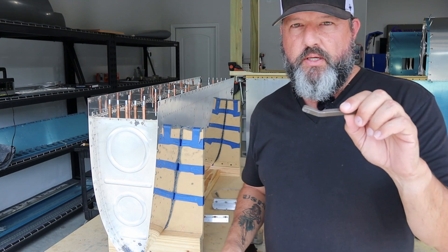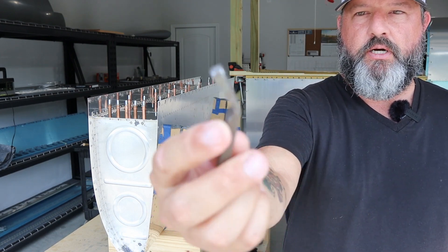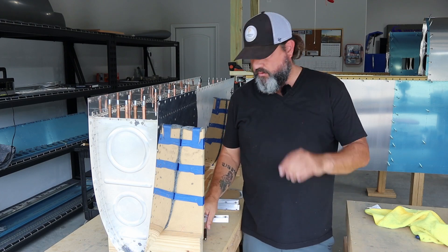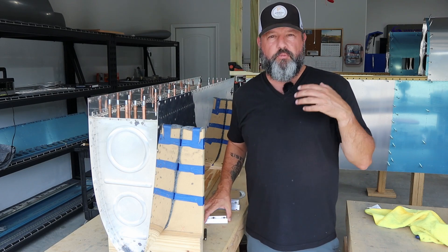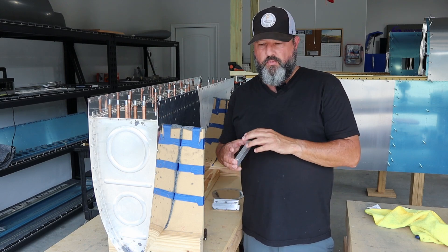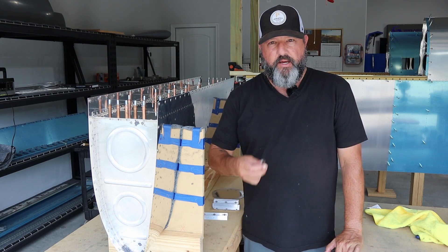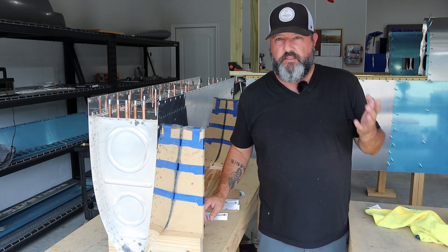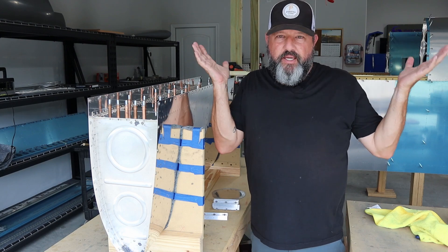I went by the airport today and Joe is letting me borrow his handy little tool for pulling rivets at an angle — this is going to come in very handy. The interior ribs are all being set with blind rivets; there are five interior ribs per fuel tank, each with five holes, which means 50 pulled rivets total. Anyway, let's just build an airplane.